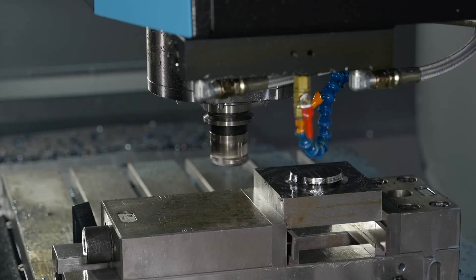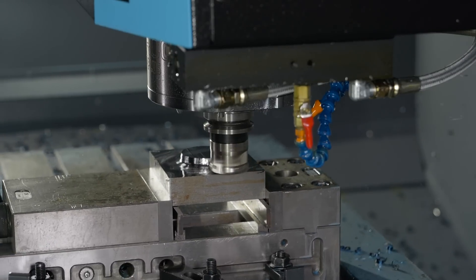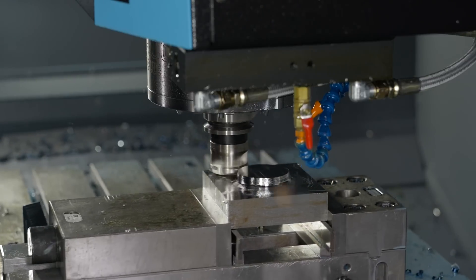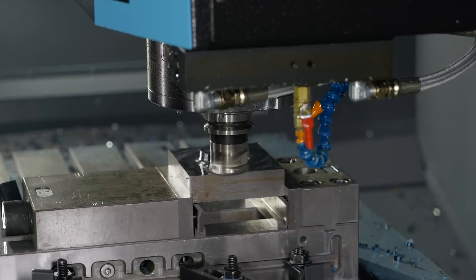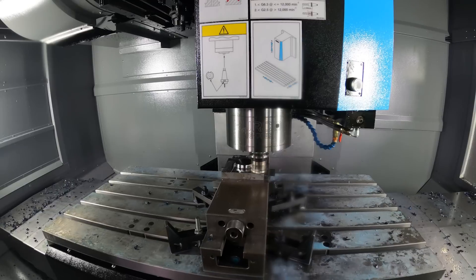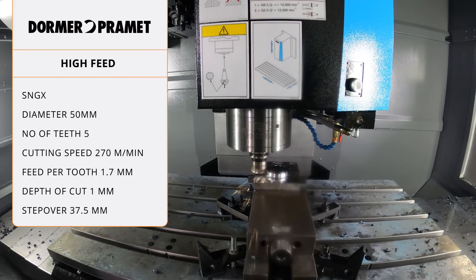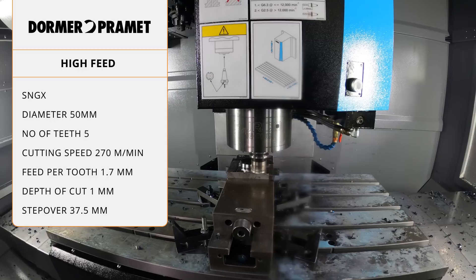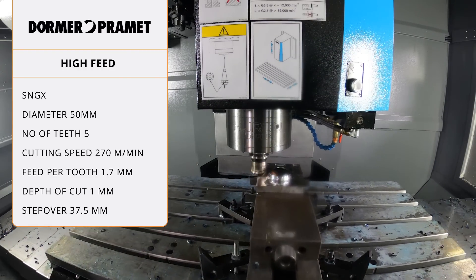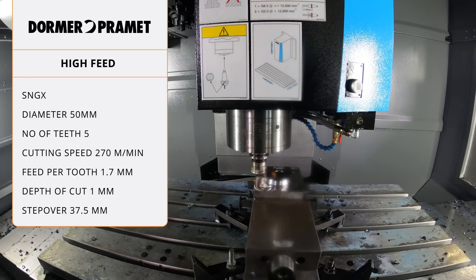It's definitely up there. On a smaller end mill it's nicer because you can get into smaller radii and do the big mold and die type components where you're z-leveling down on a massive block. You've got to think about tool life because there are long cycle times — this is where high feed comes in, getting that balance of speed and cost. A solid carbide is a high-value item; an insert, not so much — so you're getting that perfect balance.